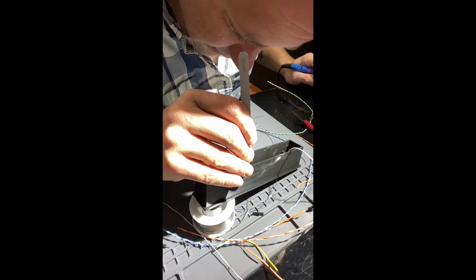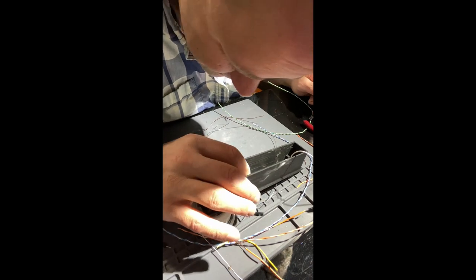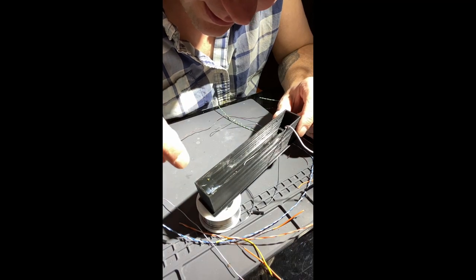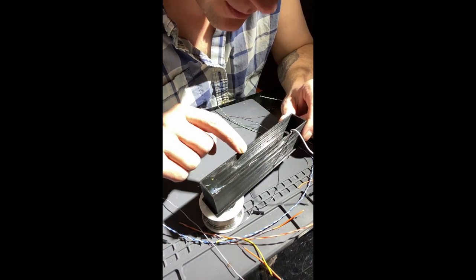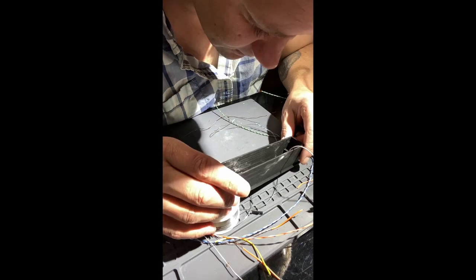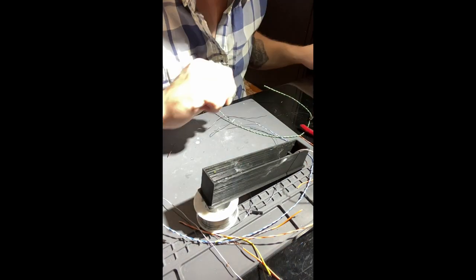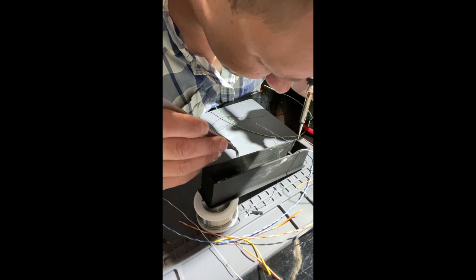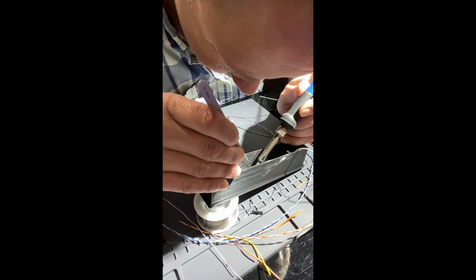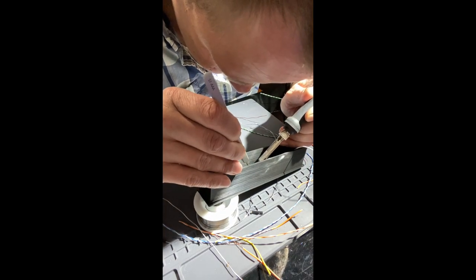You know, it's a good feeling when you get done and it actually works. So let's not get ahead of ourselves, I guess. All right, so I have a ground going across all four buttons, the potentiometer, both NeoPixels, the data coming into the first NeoPixel, coming out of the first, going to the second NeoPixel. No, I'm sorry. I have the data going in, and I have 5 volts, which, yep, I brought that one from 5 volts over to this, thinking I was doing the data. So move that over to our 5 volts. No harm, no foul.